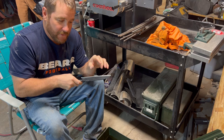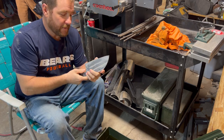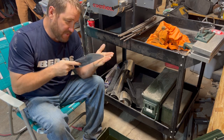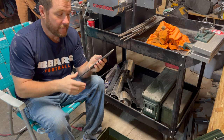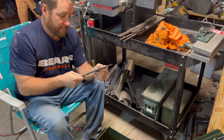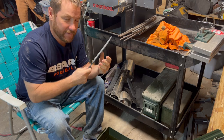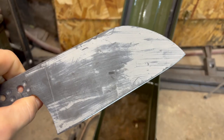If you have your hands in the same spot on the blade all the time, I notice it'll be thinner where your fingers were. On the last video I just made, I ran into a problem where there was a spot that got a burr while grinding, and the burr rolled over and fell off — so when you look at it there's a little dip. You gotta fix it on a stone and start all over again. Getting them super thin is something I still need to work on; I'd like to upgrade my grinder to a 2x72.